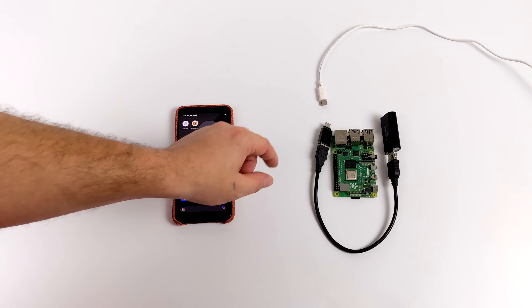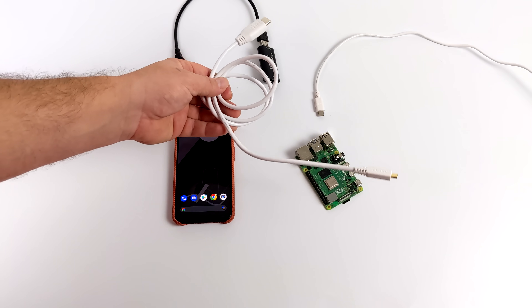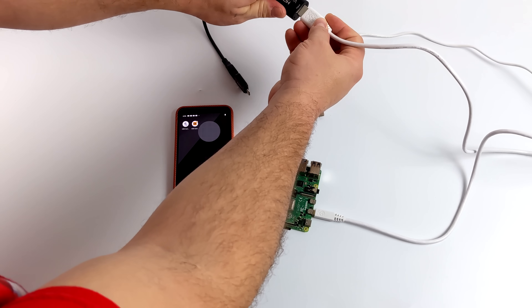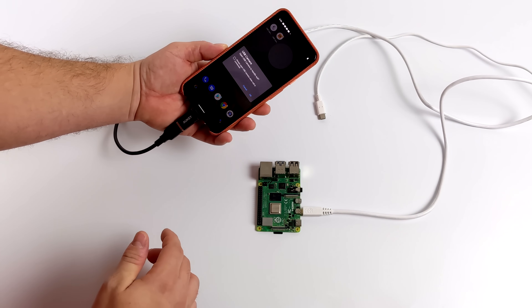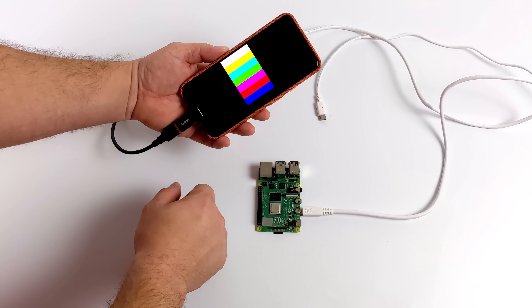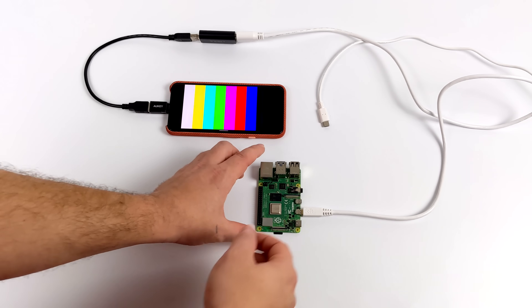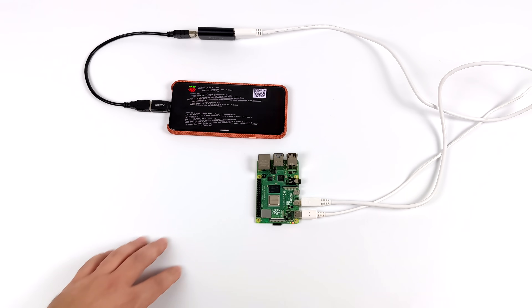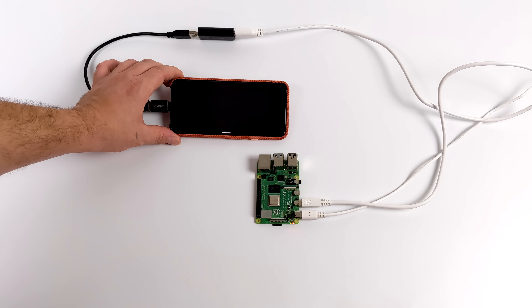Alright, so let's go ahead and get this connected. I've got my Raspberry Pi 4 here — it's actually running an SD card with Ubuntu installed. I have my power supply, here's my HDMI. We're going to plug this into the Pi, going to one of the micro HDMI ports, and take the other end and plug it right into that USB capture card. Make sure you have the app installed on your Android device, and we'll plug this directly into the phone. On the initial plugin, it might prompt you to allow access to that USB capture card. Since my app's already installed, it auto-launched. We're ready to power up the Pi — I'll plug in power and give it a little time to boot up. We have our Pi boot screen; it's going to give us the rainbow logo and boot right into Ubuntu. While that's going, I'll go ahead and plug in my USB mouse so I can control the Raspberry Pi on the screen.